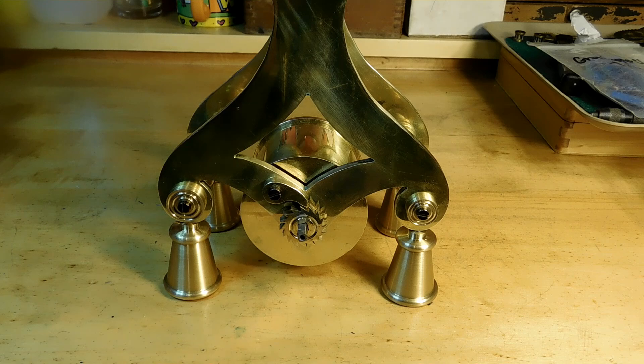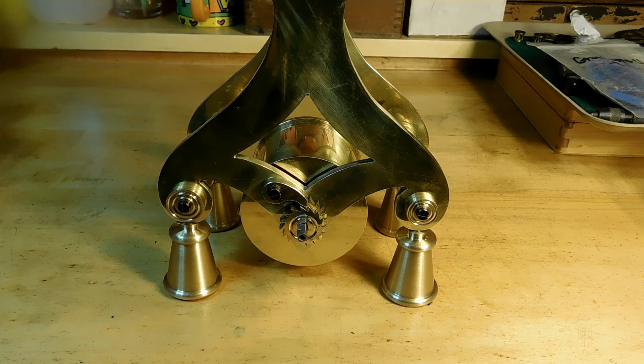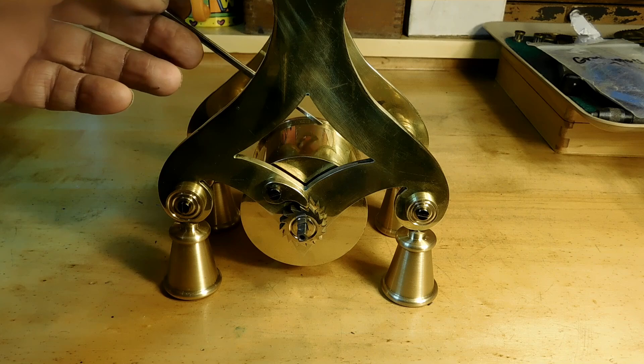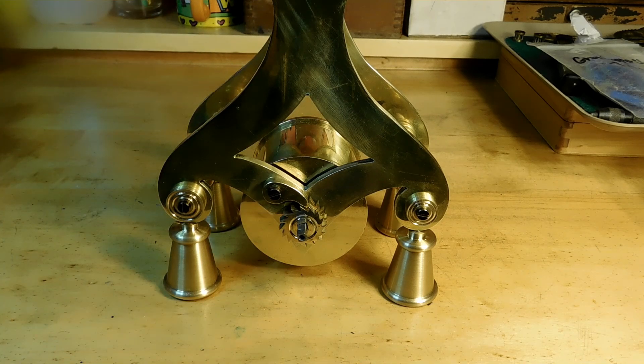Welcome to my bench. This is how far we've got so far. Today we're going to put the mainspring inside the barrel — you can see the barrel back here. It's a pretty hefty mainspring and we'll use a Webster winder to get it in there. We'll clean it all up first, then get it in there. So let me take these plates apart and get the winder out so I can give you a better idea of what we're going to be doing.